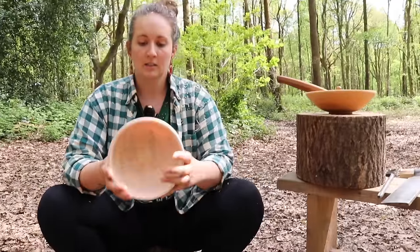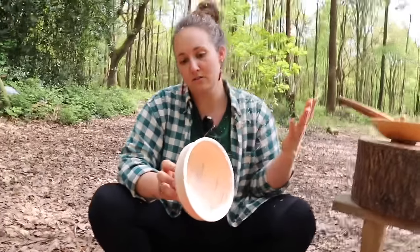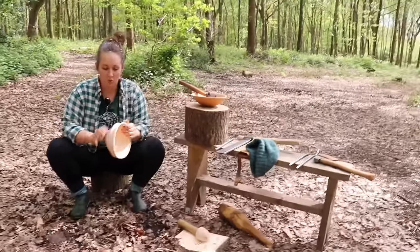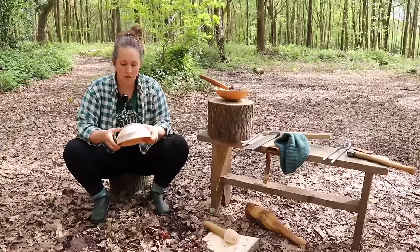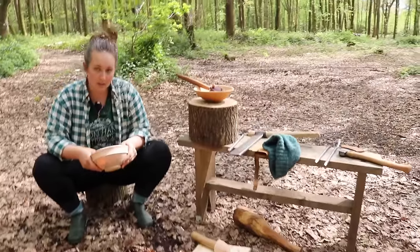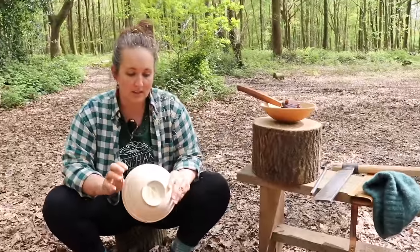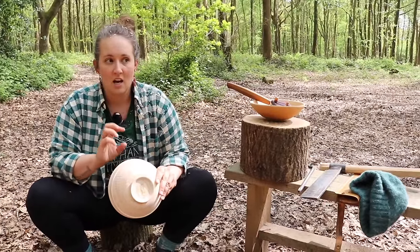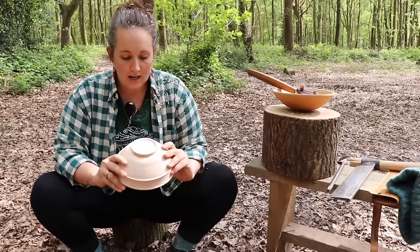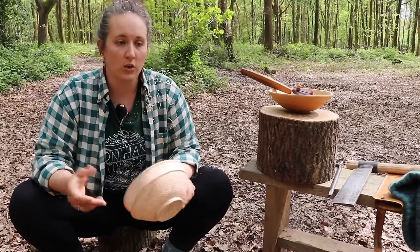Once it's dry, there's a whole load of possibilities and opinions about how to finish your woodenware. These days we use tung oil, which is from a tree in China, I believe. And we've found, with conversation with some other makers, that it seals the fastest and the best, it doesn't have much of a smell or flavor, and it also doesn't change the color of the wood that much. But flaxseed oil, or linseed oil, is very common, and walnut oil.